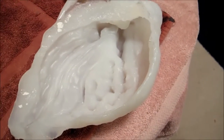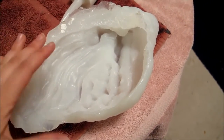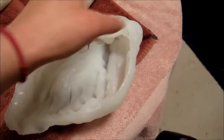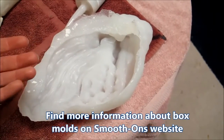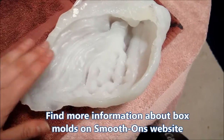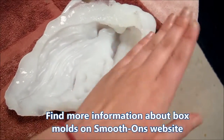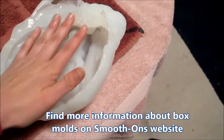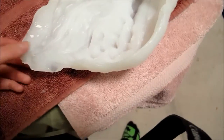So just a note, these types of molds are usually made in a box mold, and the whole piece is sealed, usually with a plank with an escape hole for any excess foam. That way there's very little surface area that you have to trim for any excess foam that comes out the top. Here we have a high risk factor: if we pour too much foam in, we have a lot of excess and a lot of surface area to cut down, and this is bad, especially since this is supposed to be form-fitting to the cast. So in this case, I'm going to be brushing this foam in and doing it in layers until I get where I want, especially in these areas here where it's a very, very thin application anyway.